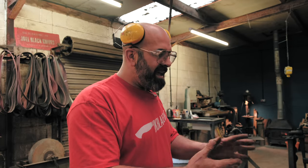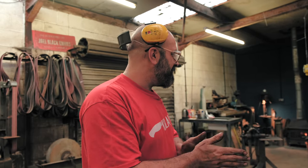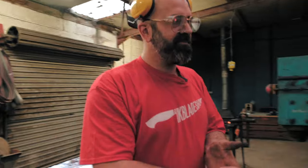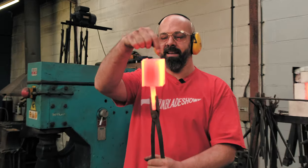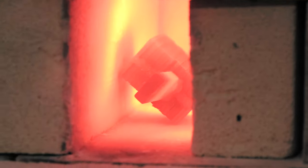If you use hydraulic presses you actually suck quite a lot of heat out of it, so I'm a big fan of power hammers — although it doesn't stop me wanting a hydraulic press. You can see how much more uniform that is now in the fire — a lot more uniform than it was a minute ago because we've got good surface contact and there are no gaps in there anymore.